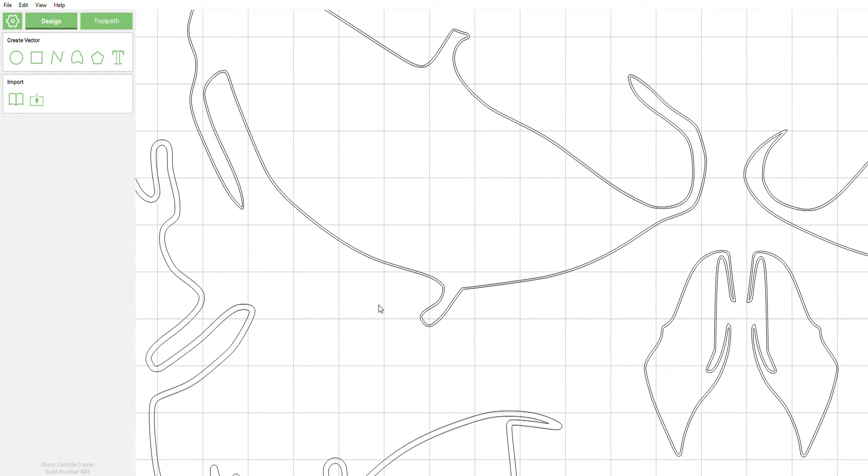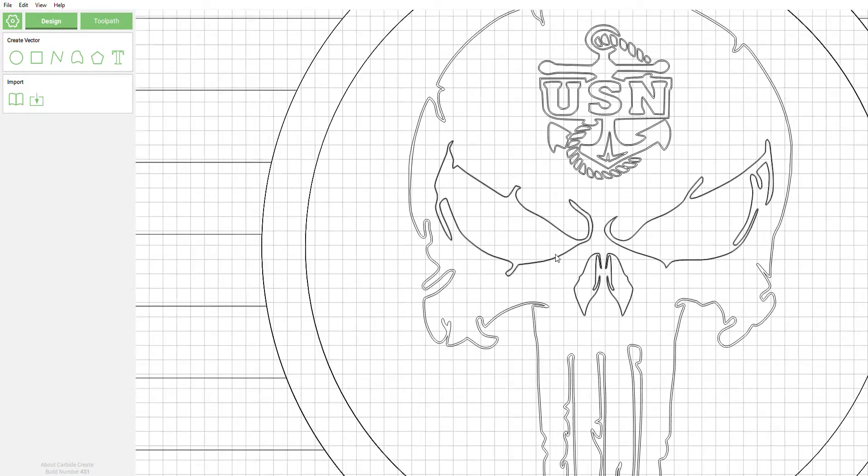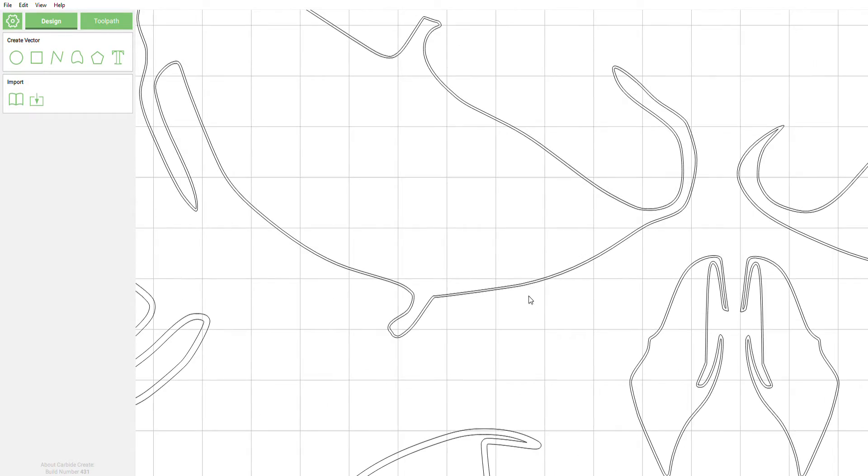This line right here is going to come out a lot better. I'd get rid of that little interior spot to make it look nicer. If you're doing a V-carve, this will come out a lot cleaner and more detailed. With a 60-degree V-bit this will look nice, whereas you'll barely see the fine detail — you'd need to drop down to a 15-degree or maybe 30-degree V-bit for that real nice detail.